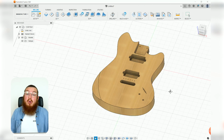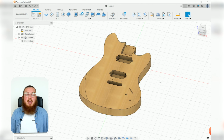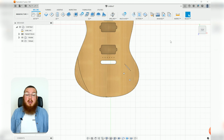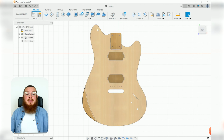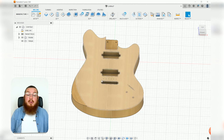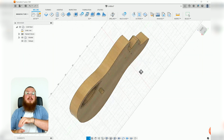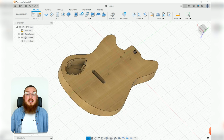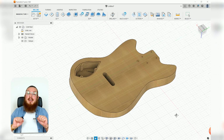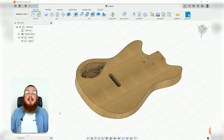We're going to be grouping all of our operations, so we can start off with a top-down view of our board, make all of our cuts using the exact same cutter, our 1/4 inch end mill that we made in the last class, do them back to back to back to back to back, then switch over to a drill bit to cut out some of the more important features in there, then flip our board over, change out to a different drill bit, cut out the rest of the features on the underside, then flip back to the 1/4 inch end mill and complete the entire project.